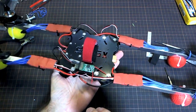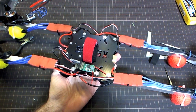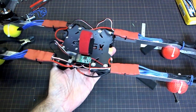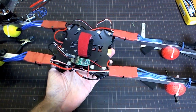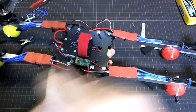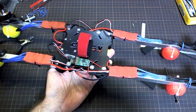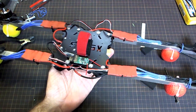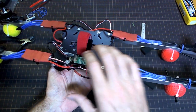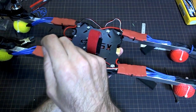My theory is that I've seen a lot of people use a clean section and a dirty section, and the dirty section is fairly large because the motors are on the dirty section connected with a hard connection, and then there's vibration damping between that and the clean section. The clean section quite logically has the battery, because the battery being the heaviest single part has a lot of inertia, so it's a damper in itself because of just the weight. Following that same logic, I'm trying to make the frame itself that weight — as much weight as possible in one block — and then keep the dirty sections small and separated.